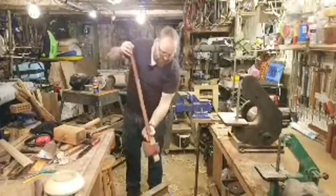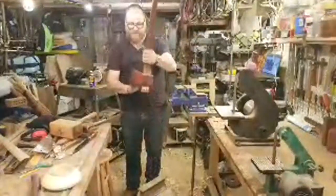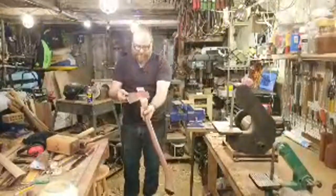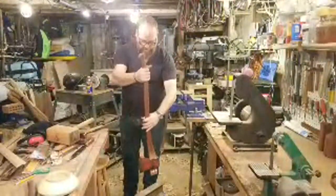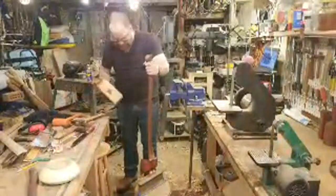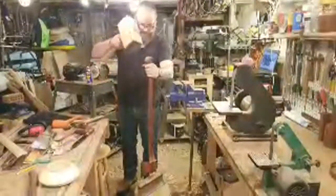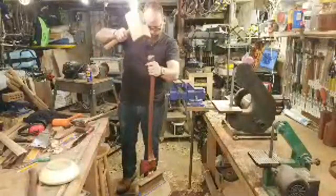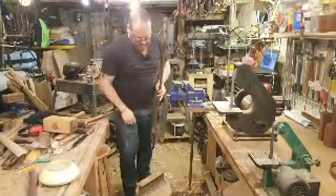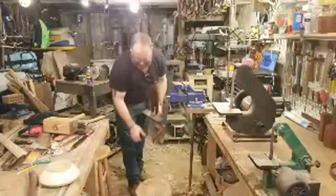If I put too much pressure, like if it's not going in straight, I kind of back it up a little bit so that way it'll go in more. But if you do that too much, it's going to split out your wedge in different spots. So I try to avoid that. Now, ideally this wedge would be going in a little deeper, but it's not, but that's okay. Give it a couple more hits. I might actually move this to the floor.